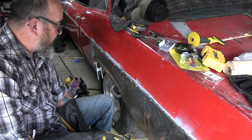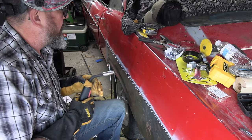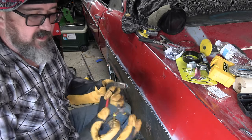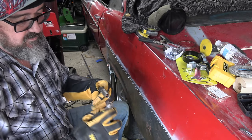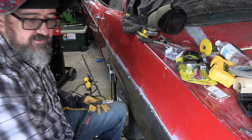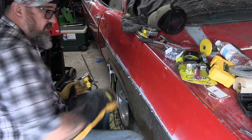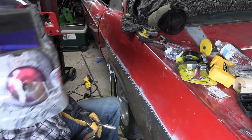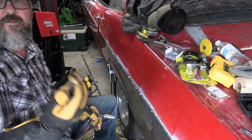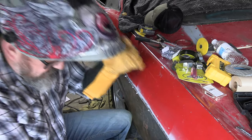For the stitch weld, I like to keep a pair of wire snips so I can clip that dingleberry off at the end. I'm going to start somewhere here, work my way down, and then blow it off to help cool it. Let's see what happens.